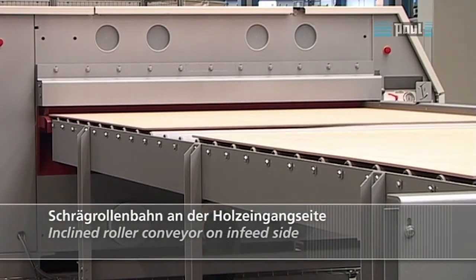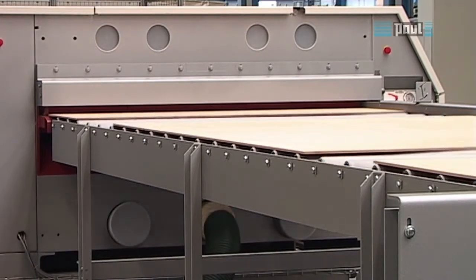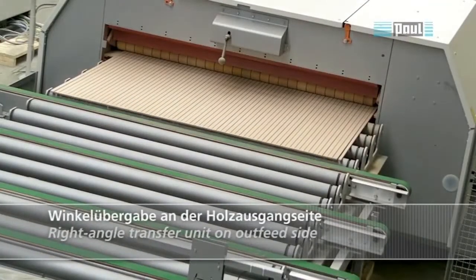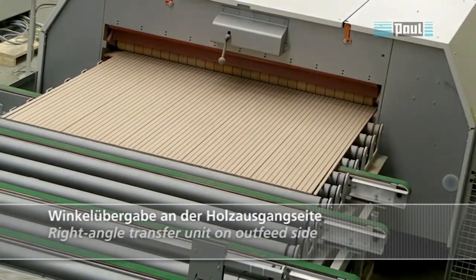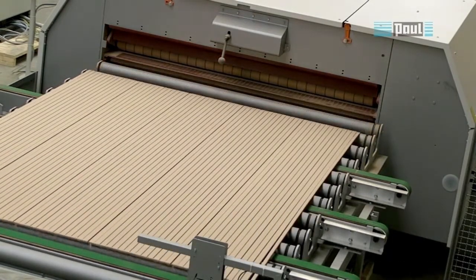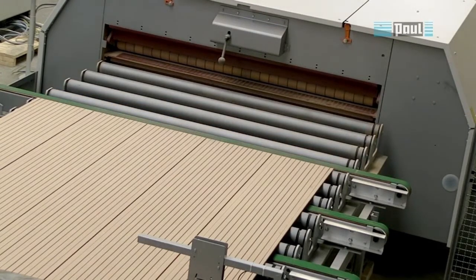Here you can see our standard M34 saw for 6 feet wide panels. Basically, you can feed them almost butt to butt. This machine has a fixed arbor. Here you can see our arbor configuration has over 100 blades fixed on the arbor with spacers based on the width that you need to cut.